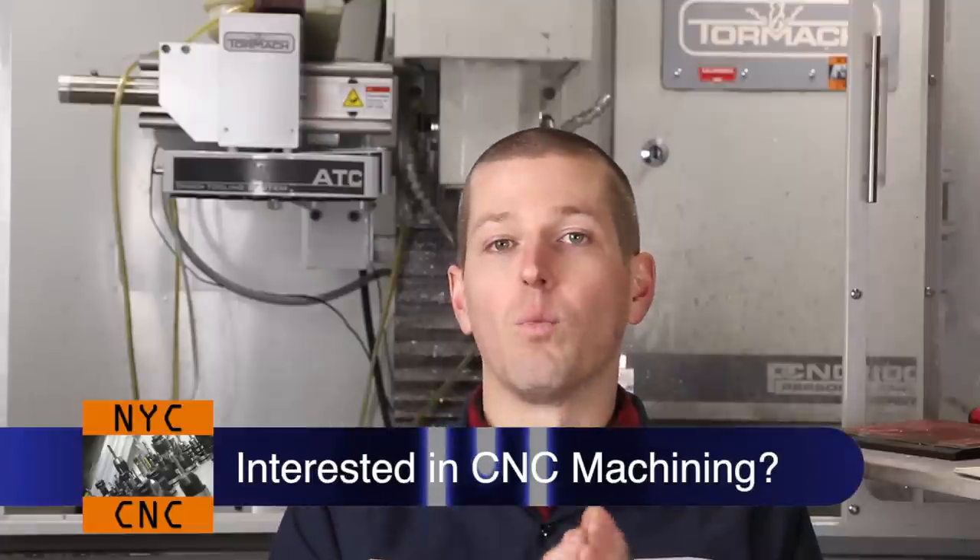And that is really the theme of today's video for us type of machinists. We're not running these huge multimillion dollar vertical machining centers optimizing maximum material removal rates and tool life. What we're doing is trying to really get the chips out. Those three elements, in my opinion, are chip evacuation, lubrication — meaning actual lubrication between the cutting flute and the workpiece — and then actual coolant, meaning cooling the workpiece or the tool itself.